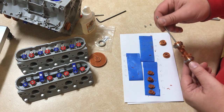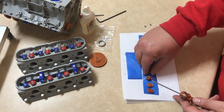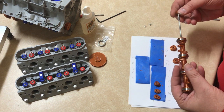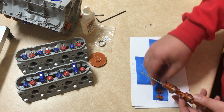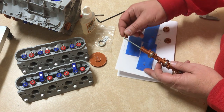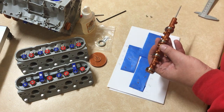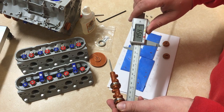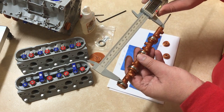I also videotaped putting together the camshaft. The camshaft is a whole bunch of pieces all glued together on a threaded rod. There are nuts about every four lobes that can be used to kind of squeeze everything together. I actually did about four lobes at a time, let them dry, and then moved on — otherwise things kind of moved around a lot. You put the four lobes on and then per the instructions you measure back to the beginning and see if it matches the spec. If it doesn't, you sand the lobes down a little bit, as they're all printed a little bit oversize.